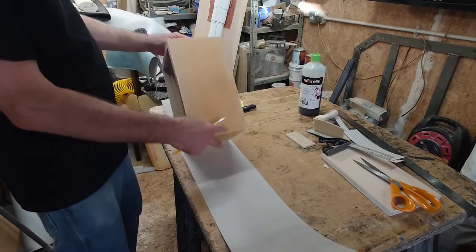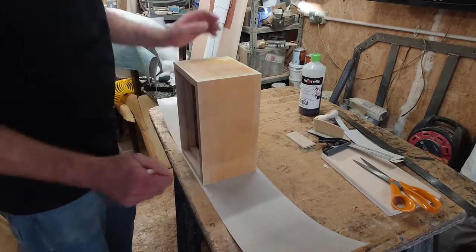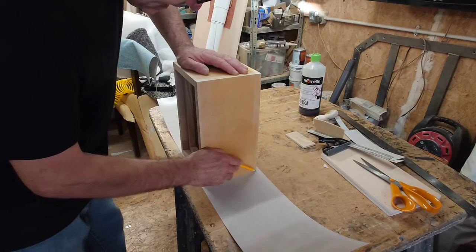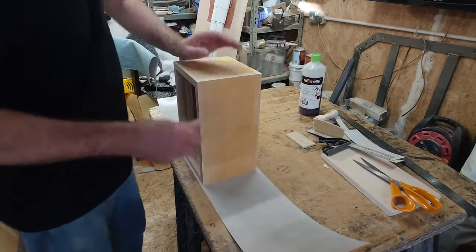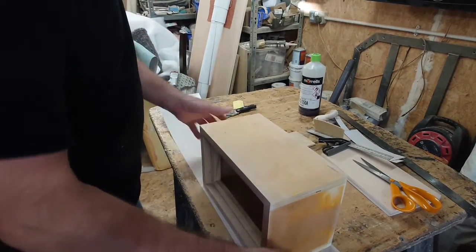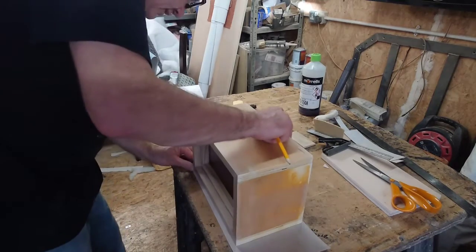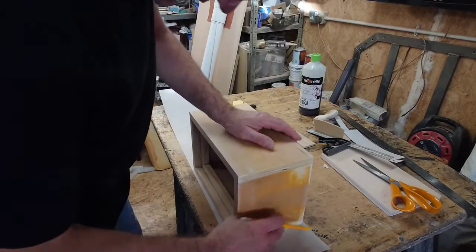Okay, I'm going to bring that over slightly bigger because we want to be able to sand back. What we want to do is match the grain as it goes through. So there'll be a gap of a couple of mil or a mil on each, but it still goes together really well. You won't notice that. Right, okay, so same with that there again.